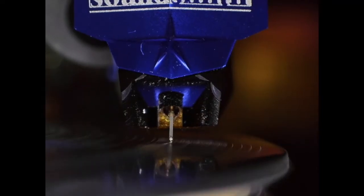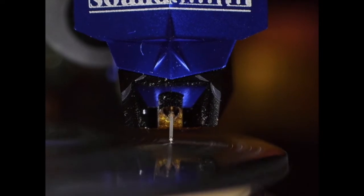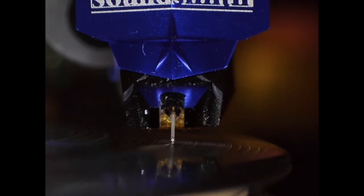Some audiophiles and even some tonearm designers completely disavow anti-skating force. There is a significant difference of opinion, so I'll give you the reasons why I think skating force is something you need to contend with. Skating force is caused by two main components: the frictional force upon the stylus riding in the groove, and something called effective moment arm. I'll place a link in the description to download a PDF presentation on this phenomenon. Here's a video of a medium compliance cartridge on a record — first not in motion, then in motion. Watch how the cantilever angle changes significantly between the moving and non-moving record conditions. It is skating force causing this angular change.